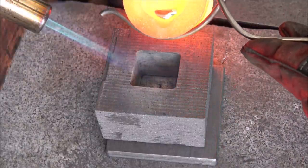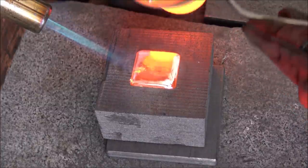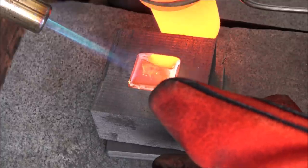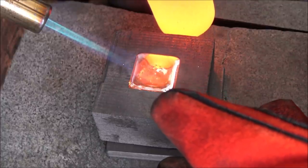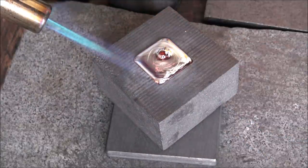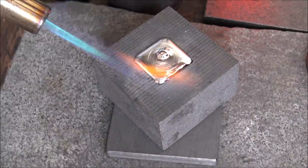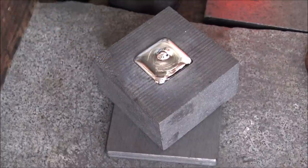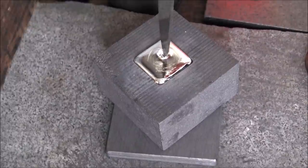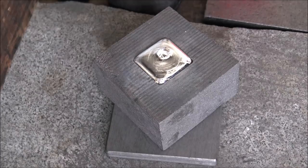You can see we're pouring the silver and it's going in really well — looks fantastic, the right amount has gone in, no overflow — but then these little bubbles start coming up through the silver. I wasn't sure what was happening, a little hesitant, and this air pocket formed, this really weird bubble right at the end. That's not the effect we were looking for at all. I decided to give it a poke with my work knife just to see what would happen and it collapsed instantly — a very very thin layer of silver on that air pocket. Of course that's not the desired effect, so it goes back in the melting furnace to be poured into a new piece.